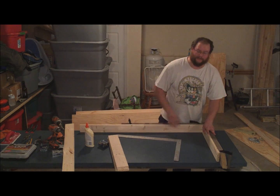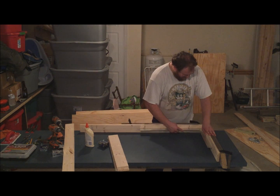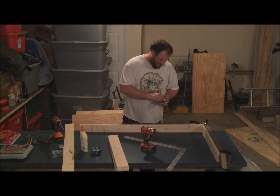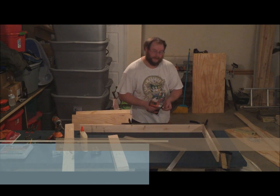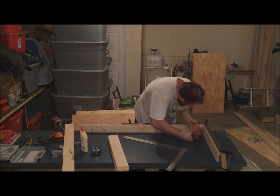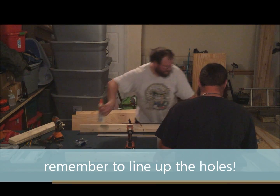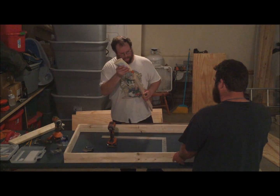By the way, this L-configuration — I just use scrap wood and some clamps and set it up with my square to make sure it was good and level. For the screws, because the jig is normally designed for 2x4s, the 1-and-a-quarter-inch screws do not work — I found they came through the other side. Make sure it's good and level as you go. Flip it over so I can glue the pocket holes on top again, and go ahead and glue both sides.